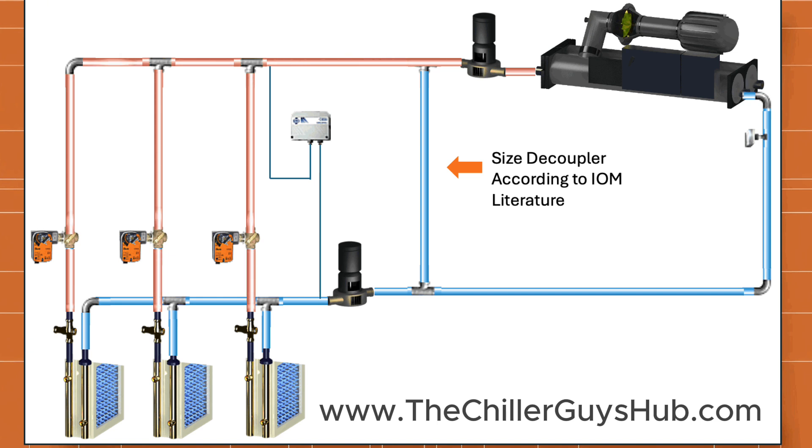Keeping that in mind, when you go into unoccupied mode you need to stage the air handlers off. You can't shut all air handlers off at the same time or you'll lose flow. If your machine is running at 100% and you feed it 100% bypass water, you're shocking the machine, not giving it time to unload and shut down properly — and it will trip out every single time. You'll come in the next morning, reset it, fire it up, and the building does a hot pull-down, so everything runs great all day. Then it trips out overnight again and the service technician finds nothing wrong during the day.